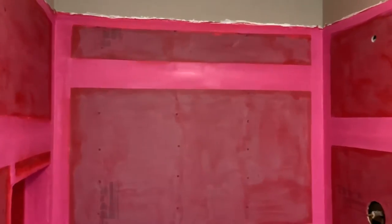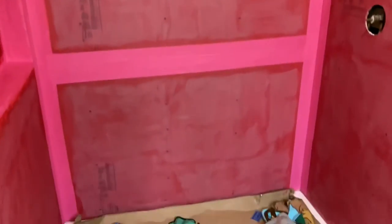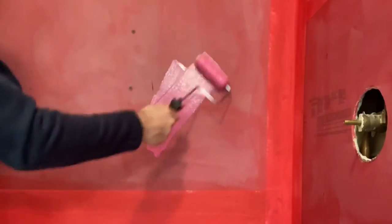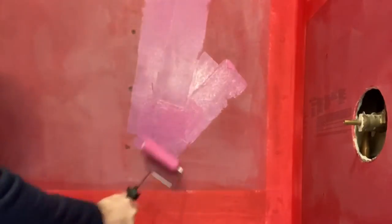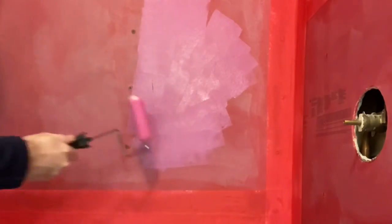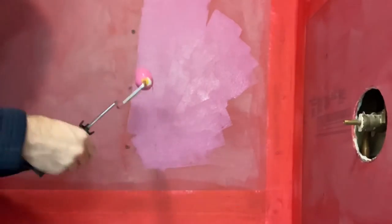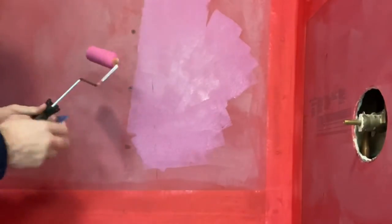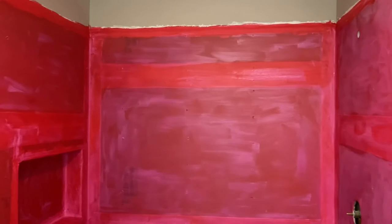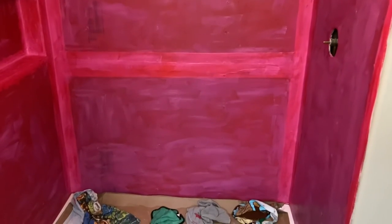You can go a little thicker than a thin layer on the fabric areas. Once the brush work is done, you could use a roller — I like a mini high-density foam roller, I'll link it below. It goes on really nicely and knocks down the high ridges that a brush might leave, but it's super thin. If you think two layers with a roller is enough, you're not even close to 25 mils.